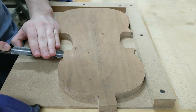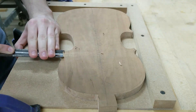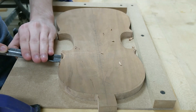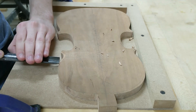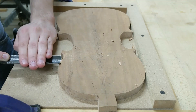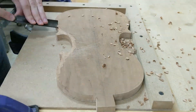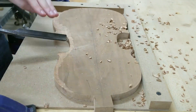You could hear my sigh there in the video. This is the start of the cherry, and I knew this was going to be difficult. That's why I started with the spruce, so I could get the experience on that before I moved on to the hard stuff. And boy, this was tough. Breaking down the edge is kind of one of the tougher parts because the gouge can only take off so much material. If I go too far down, I just won't be able to take anything off, but I spend so much time positioning it that I'm barely making any progress. It took me a while. If I would have had a better way to take down this edge, I would have had a head start going in. But I got into the groove of things — this is about 20 minutes of footage sped up — and we really went ham on this thing.